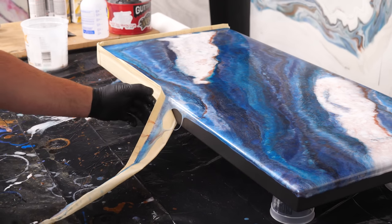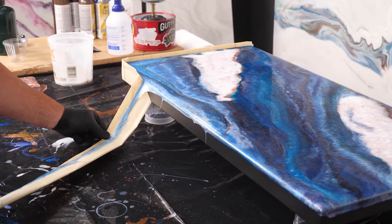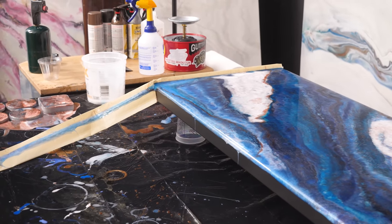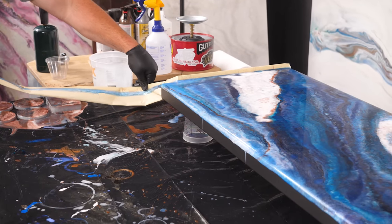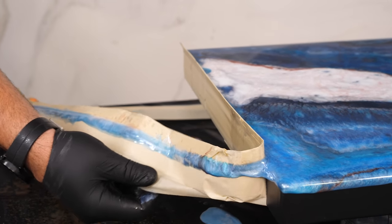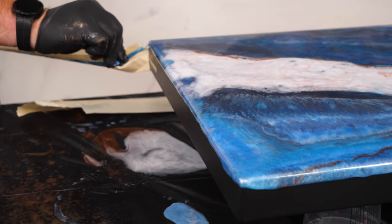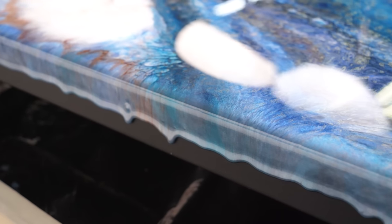I pushed the limits — it almost might be a little too late. I once was supposed to peel tape from one of Mike's jobs, went home, started playing with my kids, spaced it, came back way more set up than this. That's where I learned in a panic that warming up the epoxy with a torch held high up — you don't want to scorch it at this stage — can warm the resin and get it to flow again. But I don't think I have to do anything. I timed this perfectly. That's how you get high definition edges — the whole thing is just going to flow nice and slow right on down. This table is going to look like it was cut out of a giant slab of granite.